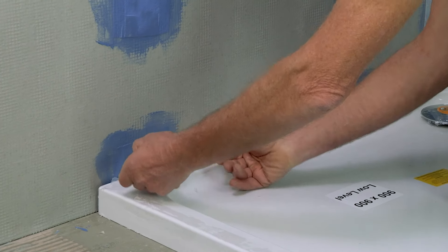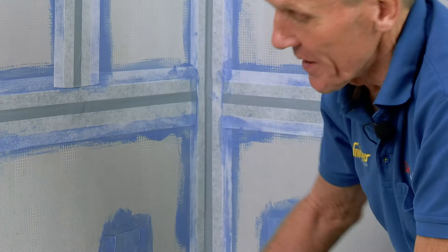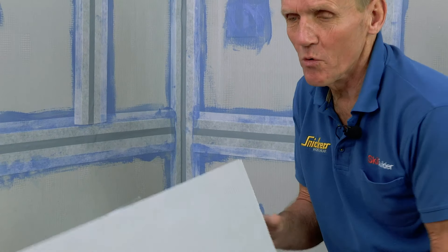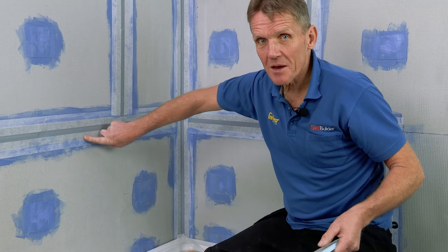Now that the surface is clean and dry, we can apply the tape. You can actually apply this tape to plasterboard, any kind of board, or even a plastered wall behind a shower or bath, but I much prefer to use this insulated waterproof board. I'm not a great lover of water-resistant plasterboard because I've seen so many problems with it in the past. On all my installations I use this board, which is completely waterproof, and when it's sealed with the tape you've got an absolutely waterproof structure. It's also insulated, which cuts down on mould and mildew in the bathroom.